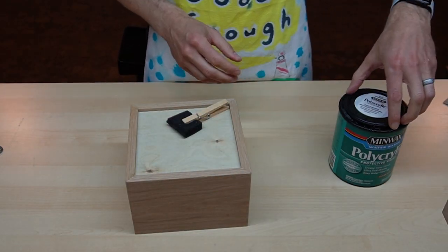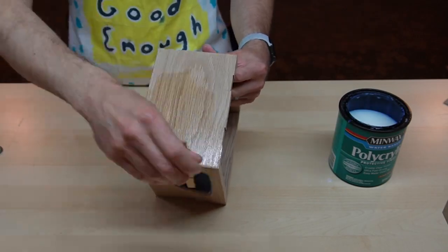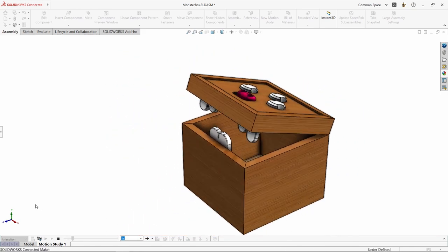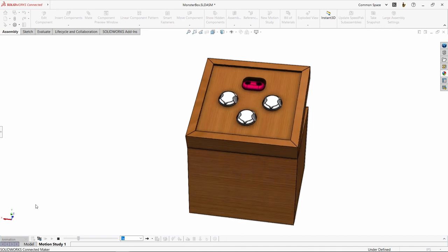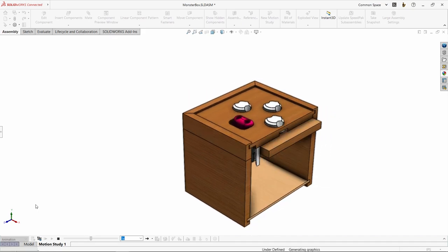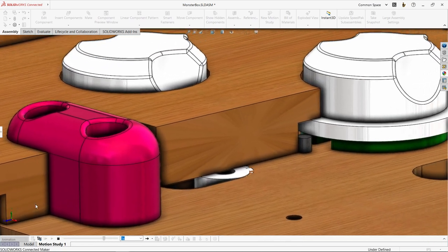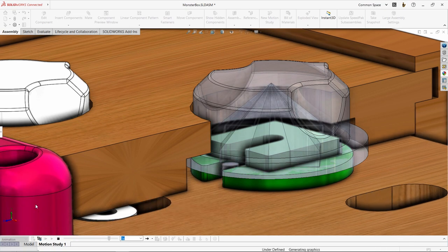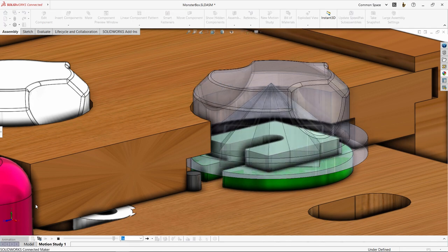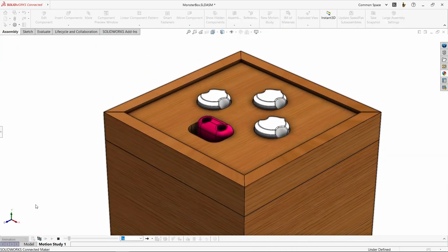Any number of finishes would be great for this project, but we've chosen to go with polycrylic for its ease of application, fast drying time between coats, and easy cleanup. With all the wooden parts complete, we can take a closer look at the unique locking mechanism of this box. I figured out everything ahead of time using SolidWorks for Makers. There's one knob that slides to release the latch so the box can open, and three knobs that twist to dial in the combination. When the knob is slid forward, the tab enters an opening in the lower teeth — in this position, the lid can't open, but the knob can still slide back and forth. To prevent that from happening, you turn the knobs in the back, which causes narrow slots in the knobs to move out of alignment. Now the small pins hit the side of the knobs instead of sliding through the slots. This keeps the tab in the slotted teeth and locks the box.